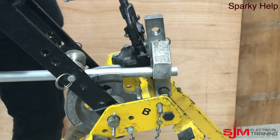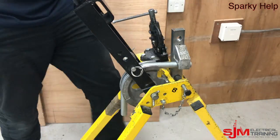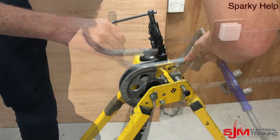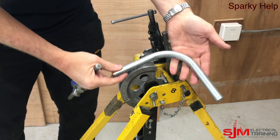If it's your bending machine, you wouldn't need to worry, because it's your mark, so you'd know. Give it a bend. Make sure you look down the side, see if it's 90, and then take it out. If it's not, you can either use — and I'd be careful doing this one — but ideally about the 25mm conduit goes over it, just to bend it out. Make sure you put it on top of the former.